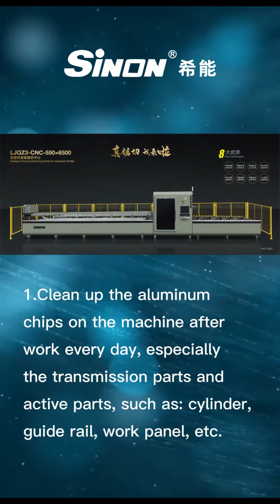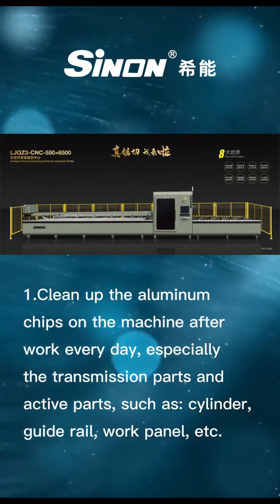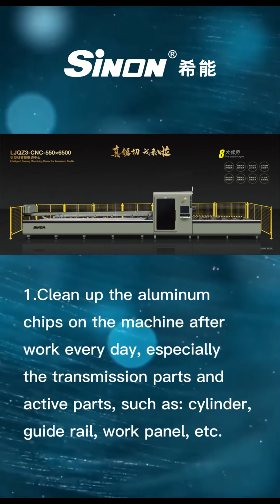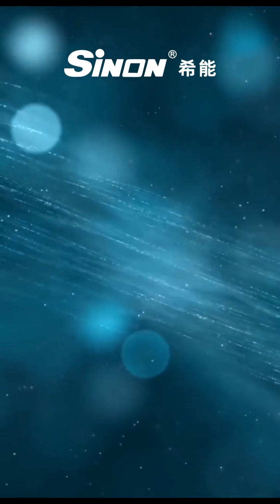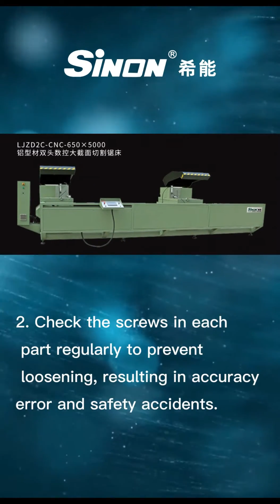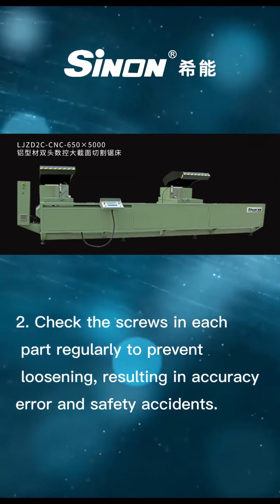1. Clean up the aluminum chips on the machine after work every day, especially the transmission parts and active parts, such as the cylinder, guide rail, work panel, etc. 2. Check the screws in each part regularly to prevent loosening, resulting in accuracy errors and safety accidents.